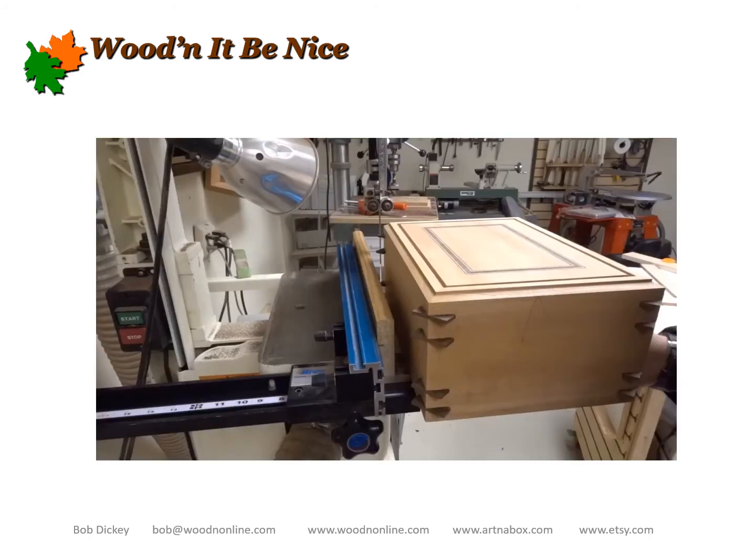So here we are set up. I've got the jig moved over to where I'm going to leave about 1/16 of an inch to be safe, so I don't accidentally gouge the side of the box, which I have been known to do in the past.